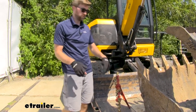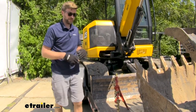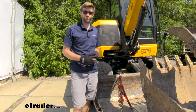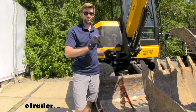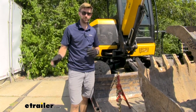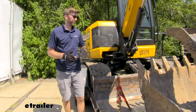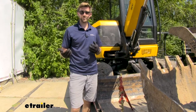We're ready to go around to the rest of our chains and make sure everything's tightened down. This is a really nice style chain — I like the length of it. We have a 25-footer on the other side and it's just too much chain for this trailer if we're going to tie it down properly. With this load, we need five chains: one in each corner and one for the boom. I kind of like shorter chains — they're a little easier to manage. One chain by itself at 4,700 pounds working load limit is not enough to tie this down, but all five together is the way to go.